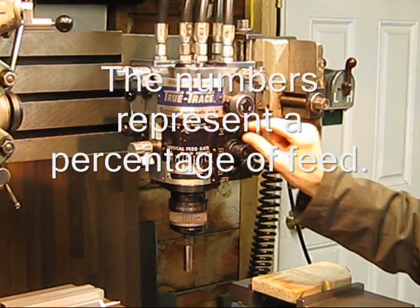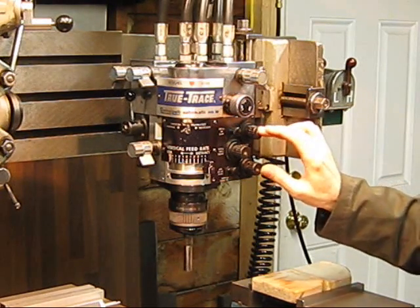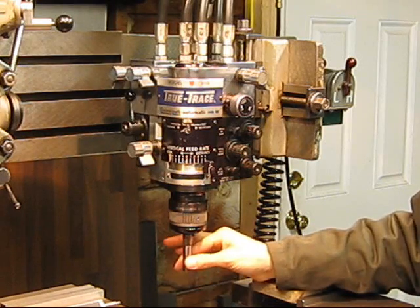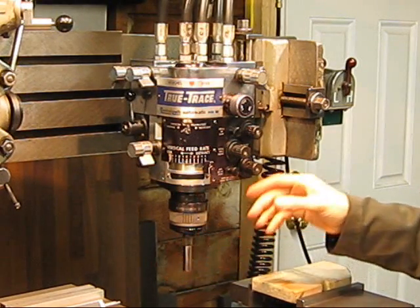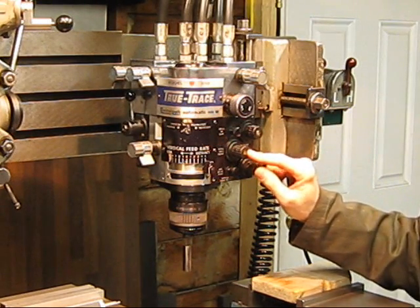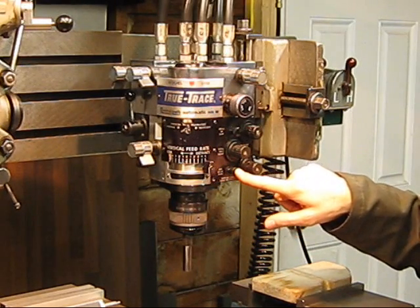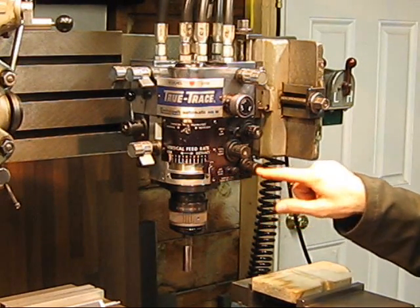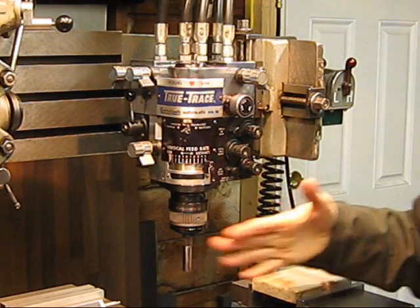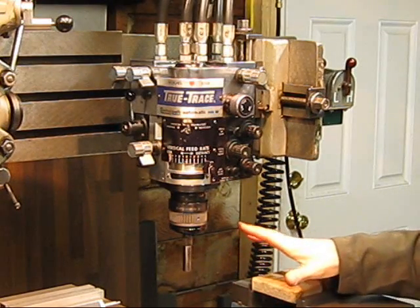Down below there's a vertical air on and off — I'll get into that later. This is a stylus pressure; there's air that actuates this and so this sets up your stylus pressure. It's like a back pressure. There's a vertical stylus pressure as well for doing 360 degree stuff. Your main valve for the air on and off here. And then the steering comes into play for steerage — this automatically traces around a pattern once you get it set up and running warmly.